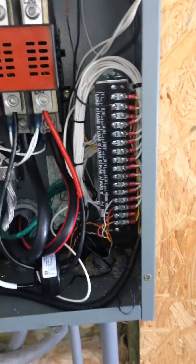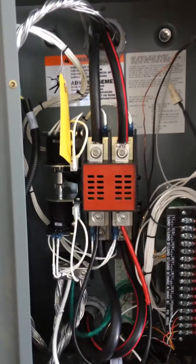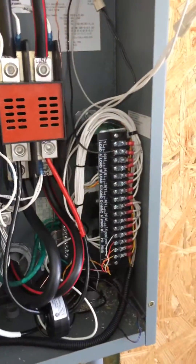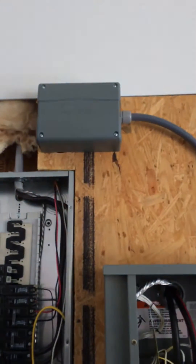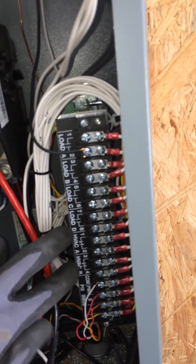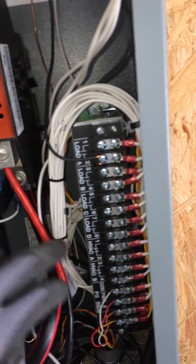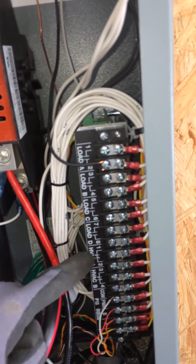This big module was added on — with a 200 amp generator we wouldn't need all this. This is the load shed kit. What it does is incorporate these relay boxes. You can shed four loads: Load A, Load B, Load C, Load D. You can also shed two HVAC loads, but you have to run thermostat wire from here out to the condensers outside — a two-wire out to break the loop to each AC unit.